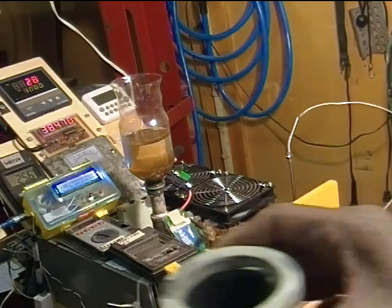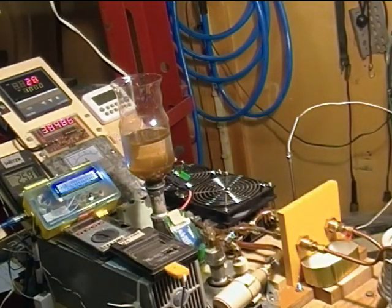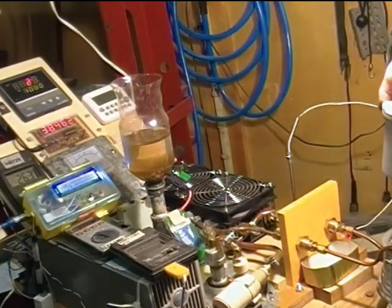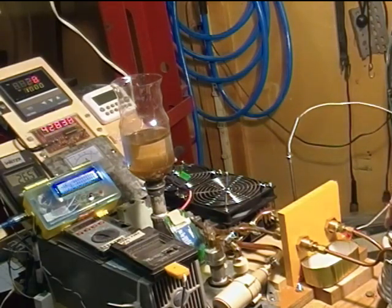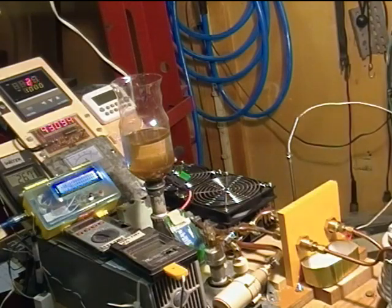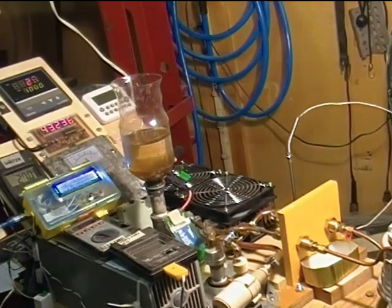The first thing I'm going to do is put this old worn graphite crucible in the stock 2 and 5/8 inch diameter work coil that comes with the machine, and see what happens. We have an SSR temperature of 80 degrees right now on the heat sink. Putting it in — we got 10, 20, 30, 37, 38, 39 amperes — and that's just to show that the system works normally as it should. The SSR protection box is reading 38-39, and the analog ammeter is also reading 38-39. Better get that out of there before it gets too hot to handle.